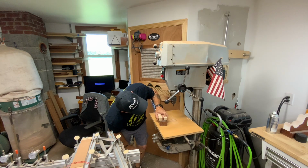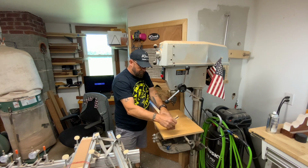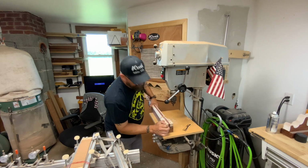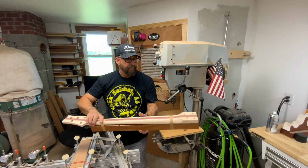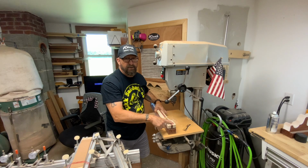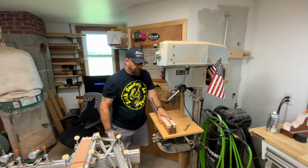About 20/1000ths of an inch underneath. Not quite a 32nd. All right, that's what we want to do. Let me go get the other inserts. That worked great. I'm very happy with that. That's what we were looking for. Just like that. And we got nice stainless steel inserts in here instead of just wood threads that could strip out. Of course, you could strip these too if you really try, but they can be replaced, no problem.